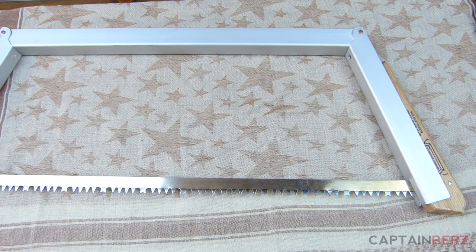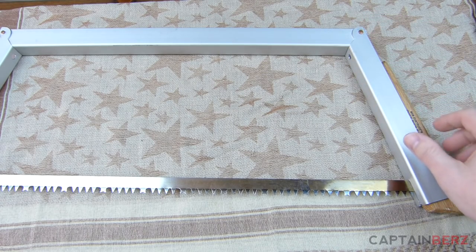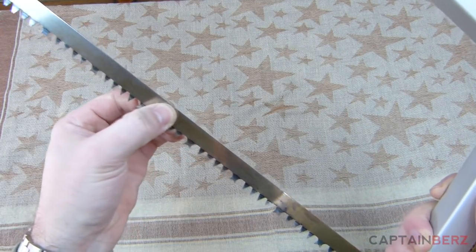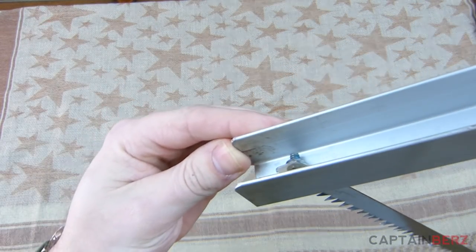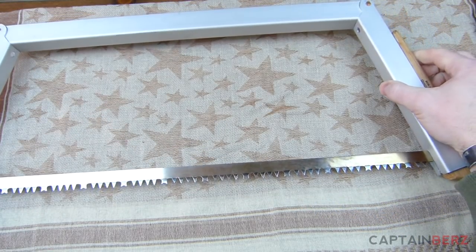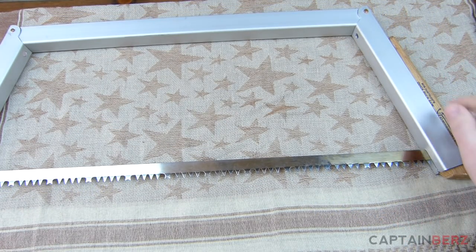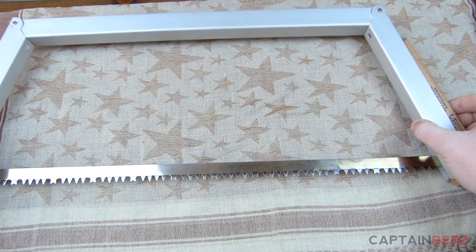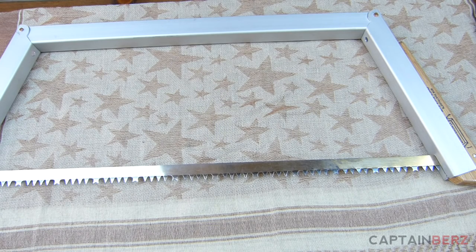It's around $50. It's made by Bob, who I believe is in his 80s, so if you're looking to get one you might want to get one soon. The blade is well tensioned — the nut holds it in place on the end. To change the blade all you do is take that nut off, take off the blade, put a new one on — done. So with a multi-tool you can make quick work of changing the blade. These Bako blades were around $10, so getting a replacement isn't expensive.